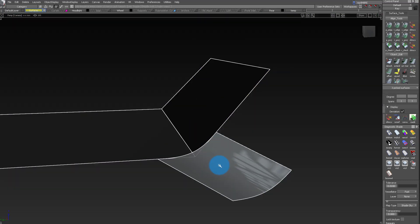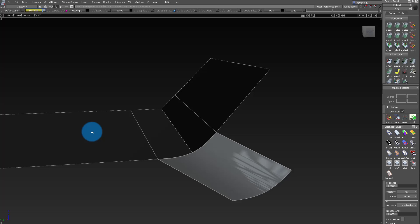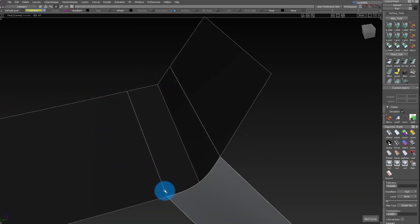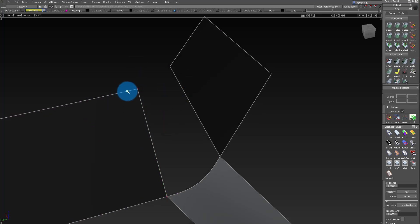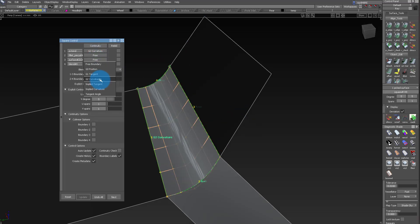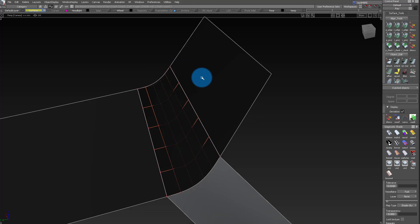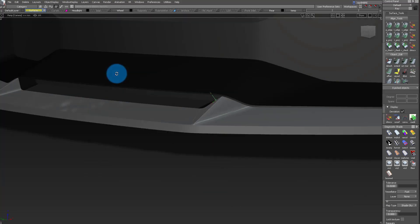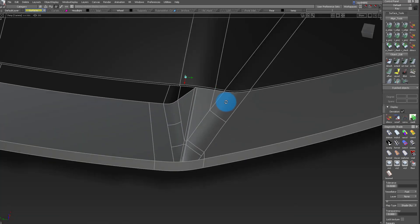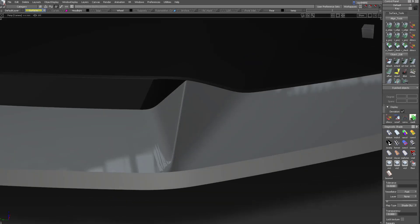Here I'm trying to add a fillet, but since I already have a corner, I'm just going to insert it. But I don't like how that angle is towards the bottom, so instead I'm going to add a curve, change that angle a little bit, and project it. Then I use a blend curve in that corner, surface that up, and now I have a little inside corner. That's it — we surfaced this little corner. All it took was about 20 minutes, fast-forwarded to 2x.